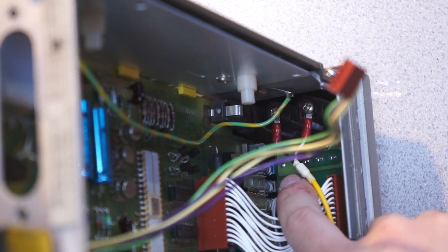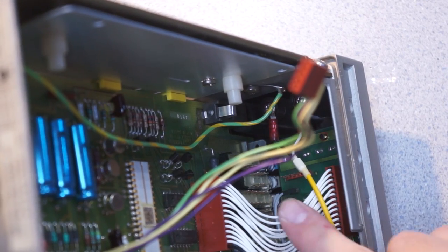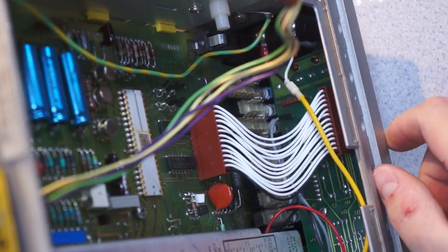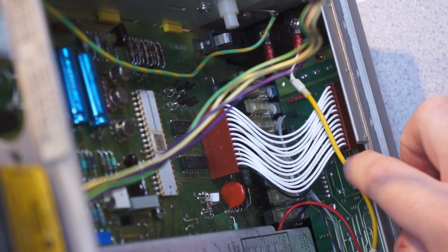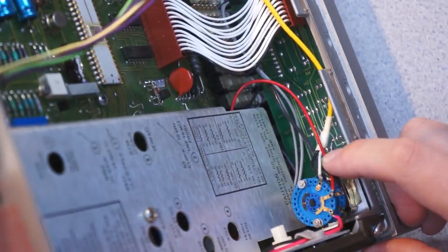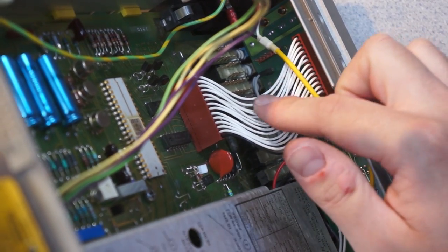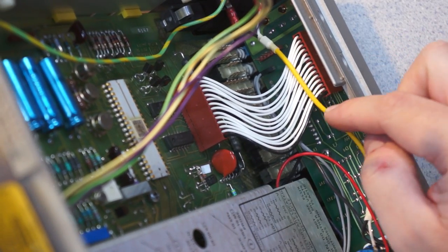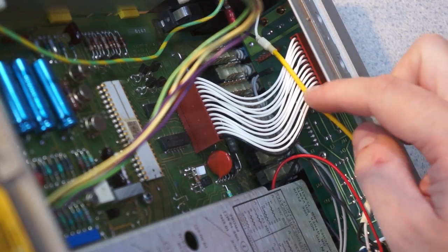there is the connector I was talking about, which I'm betting is just for these three LEDs up here. So here's the display interface ribbon cable, or, well, it's a parallel cable. You can see here, this is kind of interesting. So here are the inputs, and then they run it through a coax just over to this switch here. So I bet what's going on here is they were having issues with the front panel display multiplexing, because I would imagine it's multiplex coupling into this connection. So they had to shield it while it passed over those.